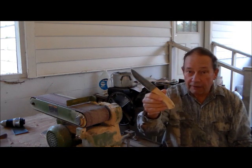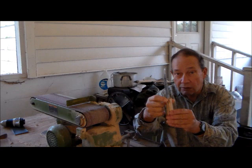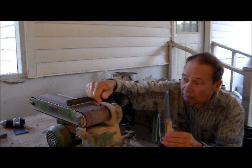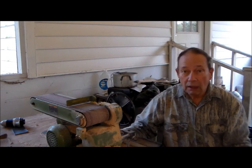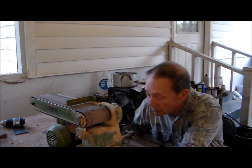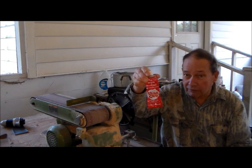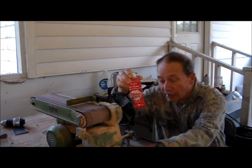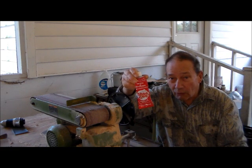We have been working on a knife kit with this belt sander, and unfortunately this metal tip right here caught the sanding sheet and tore it. What to do? Well, we are going to attempt to repair it. What we're going to do is use our friendly Shoe Goo here, which is a flexible adhesive, canvas, wax paper, and this dust as a release agent to do the repair. I'll show you how it works.